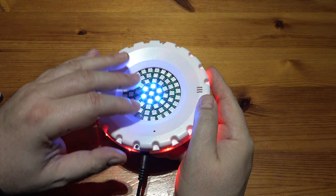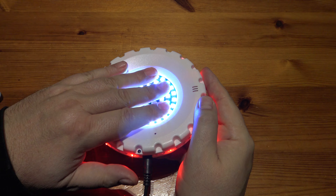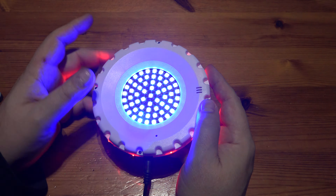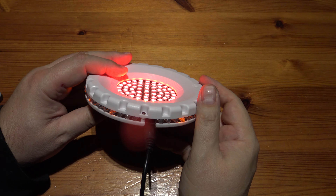If you're thinking of putting a display — like a crystal or something — over the top of that, make sure there's a bit of an air gap because they're getting warm. LEDs can last for years and years as long as they don't overheat, so make sure there's plenty of air. That's my recommendation.